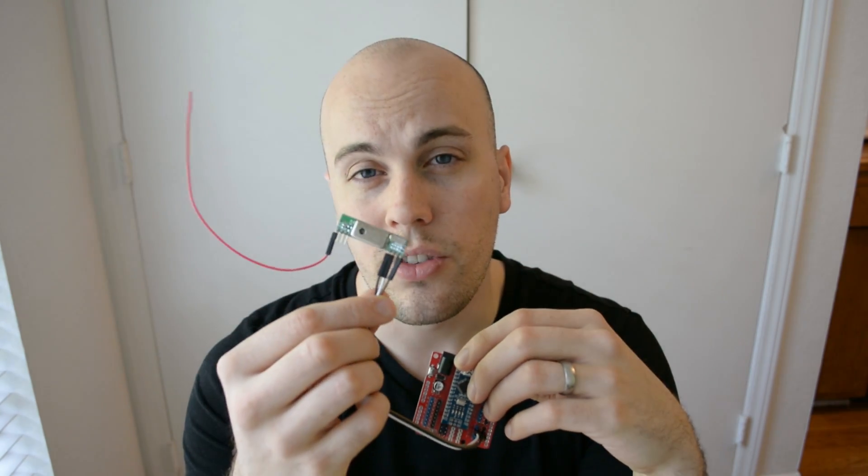And that's it! Now let's talk about control boards. In my current configuration I'm using an Arduino Nano with a protoboard and a 433 megahertz receiver. The system works great, especially because I already had a Raspberry Pi with a 433 megahertz transmitter. But I wanted to come up with something even simpler — that's why I got this NodeMCU chip CH340. I got this on eBay for about five bucks, and there's a link in the description. This chip is based on the ESP8266 series of chips. Think of them as a five dollar Wi-Fi enabled Arduino. They're extremely capable and work great. The great thing about this chip is that the only other thing you need besides your servo is a micro USB cable and an old USB phone charger, which most of us have laying around anyway.